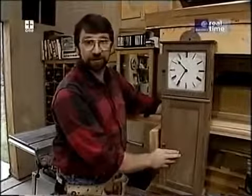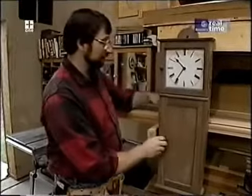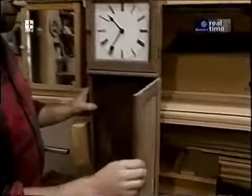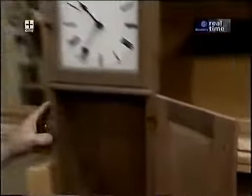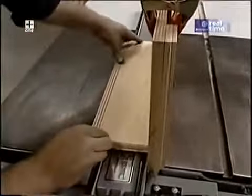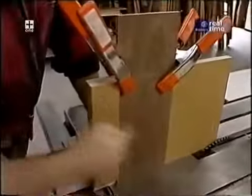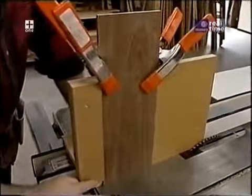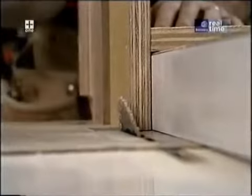I need a wood panel for my lower door, but I only have room for a piece that's about an eighth of an inch thick — and that's kind of flimsy. So I'm going to use an old-timer's trick: take a thick piece of wood and bevel the edges, sort of like a raised panel, to give extra strength. I've made a jig for my table saw — a few pieces of plywood screwed together that slide along the rip fence. With the panel clamped in place and the blade tilted to a 15-degree angle, I'm ready to make the cuts. It works great.